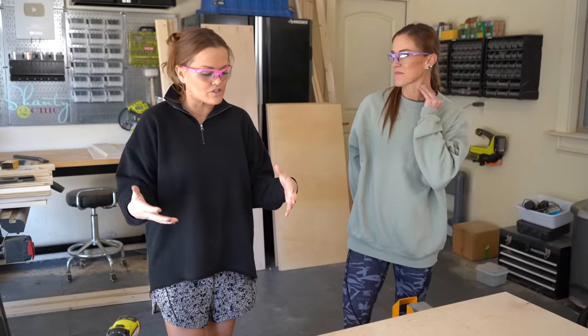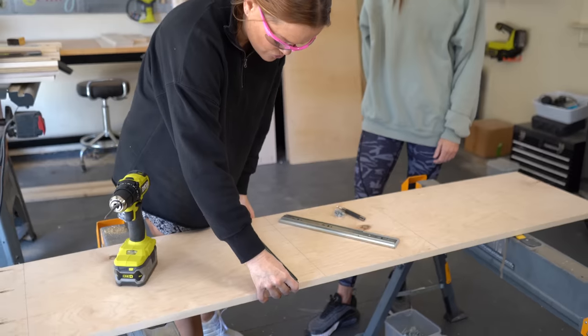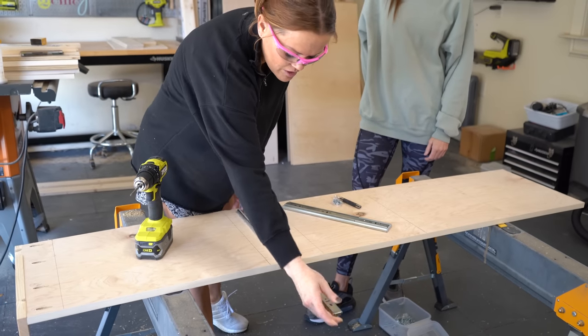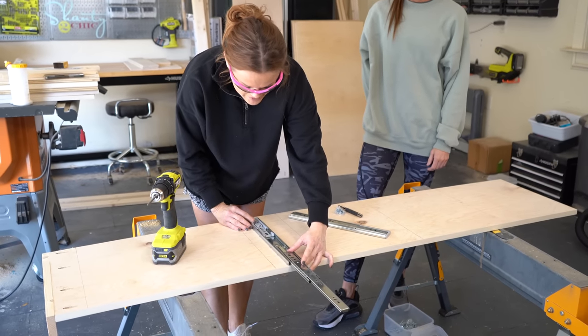At this point, we're gonna go ahead and add drawer slides because it's the easiest place to do it. So I've marked where they need to be. These are 14-inch drawer slides. I can link to them in the description box. And I've marked where they need to be from the base. That'll show that to you in your plans as well.